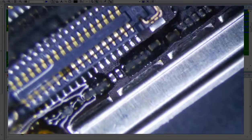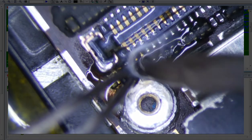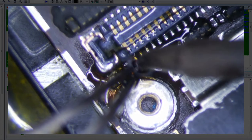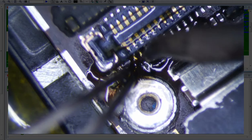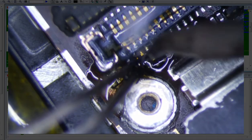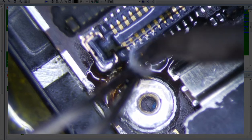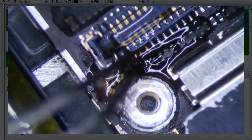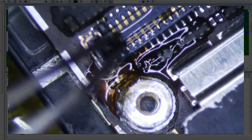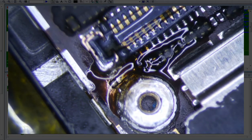We will try this side again. It doesn't look like it's actually connected yet. But this is definitely not an easy job — I'm still having problems with it. It's because there's lead-free solder down below there. This stuff is gumming up. I might have to get the .1mm tip out, but I'm going to clean this old flux away and maybe get rid of the old lead-free solder.